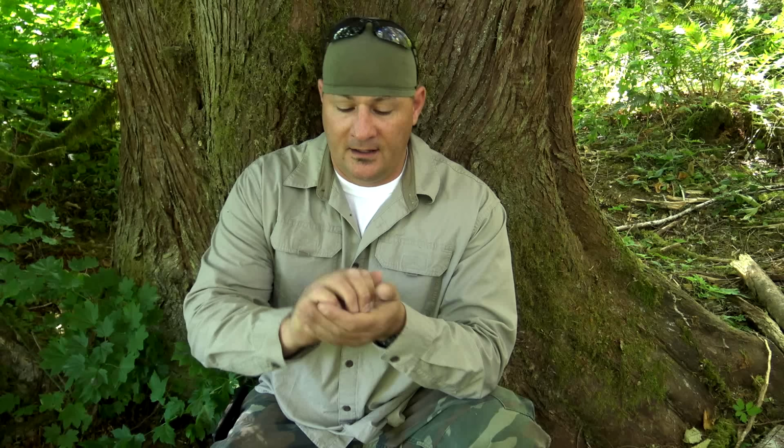So what the Romans did is they would take that Play-Doh concrete and they'd put down a layer. Then they would grab fist-sized rocks. And those rocks could be ordinary rocks, volcanic tuff, volcanic rock, pumice, etc. And they'd work it into that paste all the way down that line. Then they'd come back to the opposite end and grab some more of the concrete that resembled Play-Doh and they'd put it across the top of those rocks. Then with special metal or wooden tools, they would force by tapping that concrete into the pores of those rocks all the way down the line and just repeat the process.